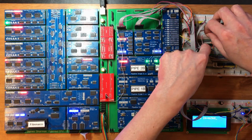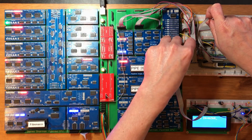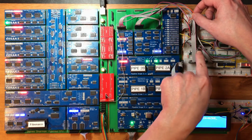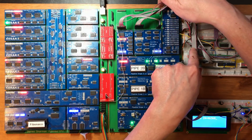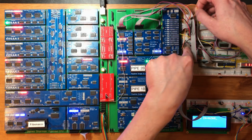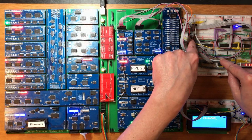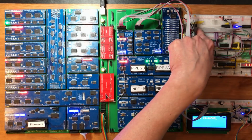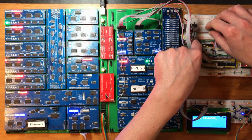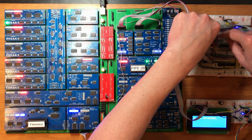Now we have made some of this wiring redundant, so those were carrying the control lines down. That is the 4 bits of logical operation selection. So that's the ALU clock. It's not being generated here anymore, but it's actually coming back from the output here to drive this board. That was the system clock, so we shouldn't need that anymore. That was logical carry, which gets stored in the latch along with other flags. So they were producing the logical combination as part of generating the ALU clock. So that was ORing together them all. But that was two input OR gates.